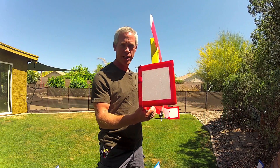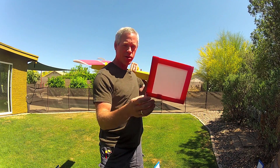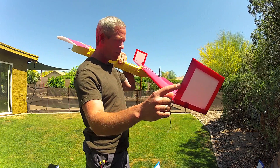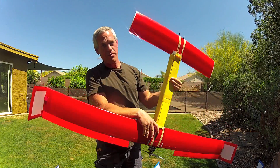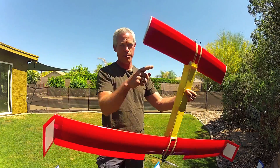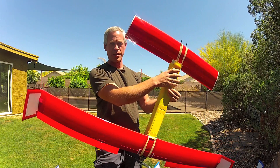It's square in every way — 90 degree angles — but there would be nothing wrong at all with sweeping this up. I've also used the vertical stabilizer as the mount for my Dragon Link receiver antenna, so it's 30 inches away from the nearest electrical component, and once I put the video gear on the nose, it'll be that much further away for a very clear radio frequency environment for both the receiver and the video transmitter.